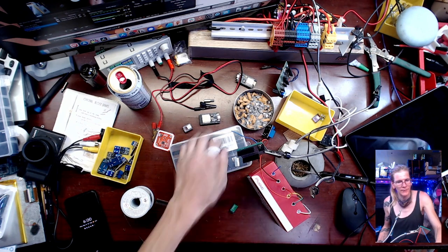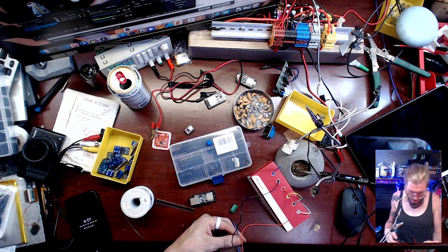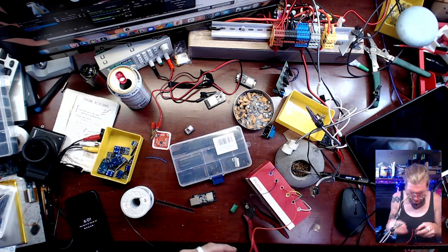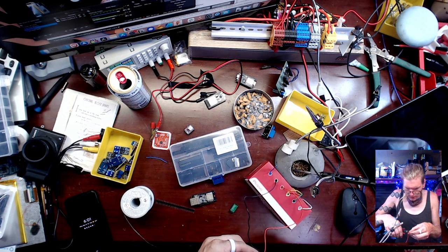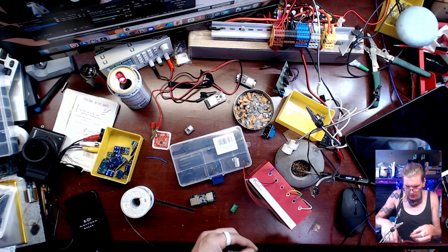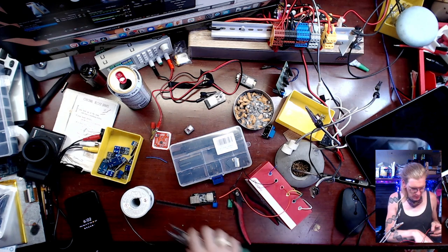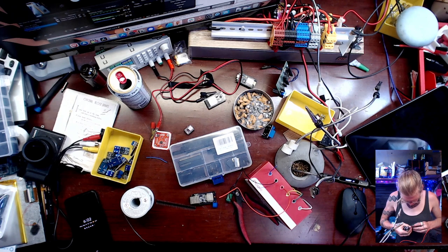Yep. There you are. All right, so you have to go there, so you'll get cut there. And then, what did we say about this? You'll go here. So you want to cut your wires just a little bit long, and you'll get used to this, but you want to be careful that you're not going over or bridging other connections with your wires. You want to make them as flush as possible. Ah, don't let that happen.